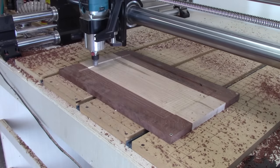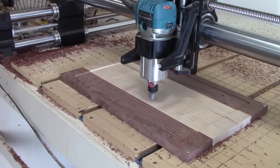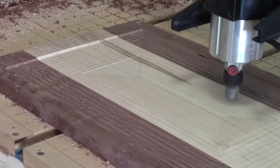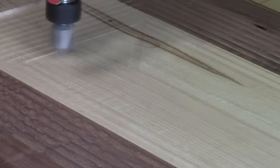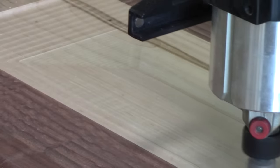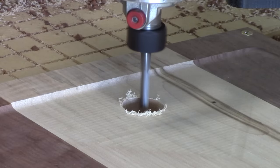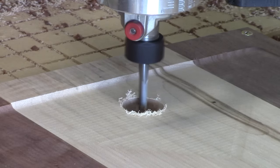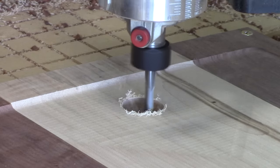Once we're finished, we're going to do the same thing again, except we're going to turn our step over down to about 10%, which is going to give a nice smooth finish. As you can see, it's going to get rid of all those ridges, and we can go a little bit faster because we're only going about an extra 0.01 inches. From there, switch over to a quarter inch bit. My down cut bit is pretty rough right now — I've got to order a new one — so I'm just using an up cut. No problem, I can just sand that off. And this is going to be the hole that the dowel is going to fit into.